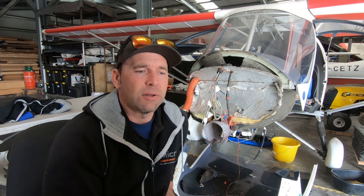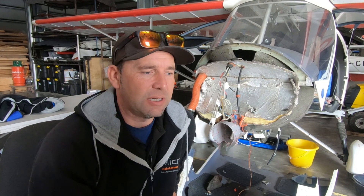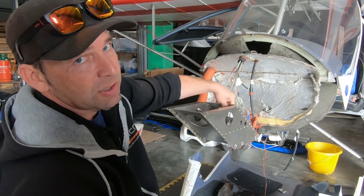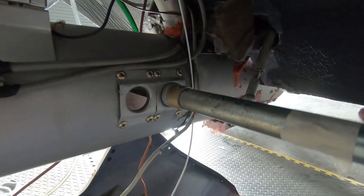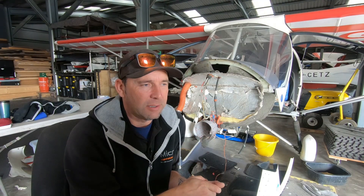There were lots and lots of little things — fuel pipes being cracked, a few wear and tears on brackets. But what she did spot, which was very concerning, was that the engine cradle is cracked. For those who don't know what a C-42 engine cradle looks like, it's one of these — fits there, engine sits on top. We've got several C-42s in our school and I've replaced the engine cradle on ours about four times. We also found that the rudder pedals were quite loose — the bushing that goes through the main keel tube had worn and there was a lot of play in the rudders.